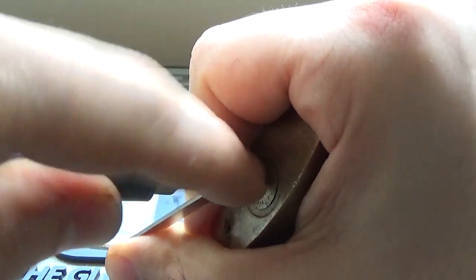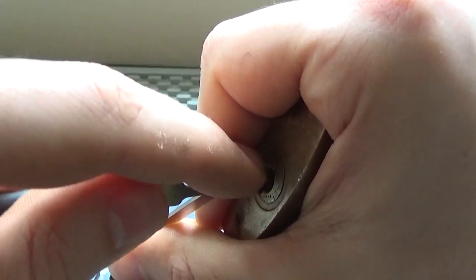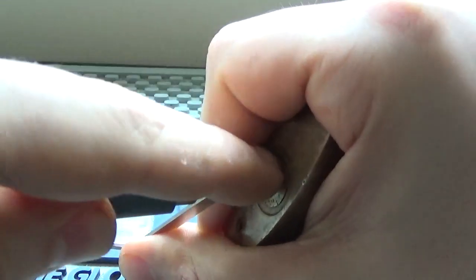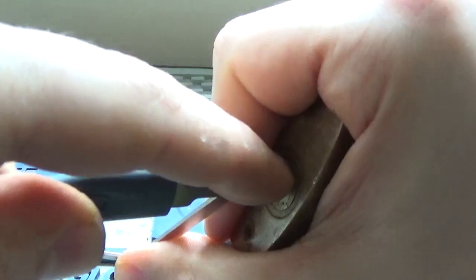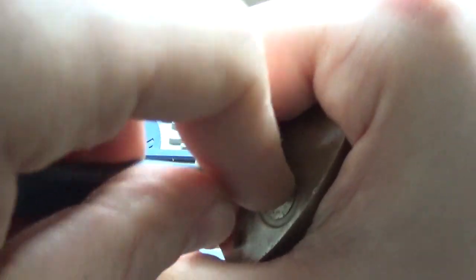Might need heavier tension to persuade him to open. I mean, I can have a hard time with the 265 padlock for some reason. I know we won't be shimming this one because it's already open. Combing it open, well, I don't know, it could be a bit risky because of the seized up nature of the lock. You don't want to break a comb pick inside of this thing.